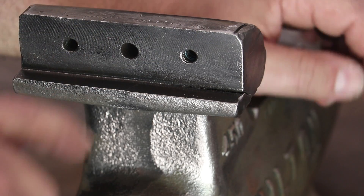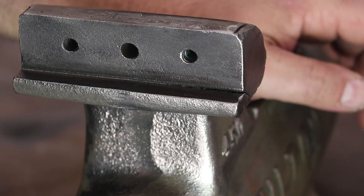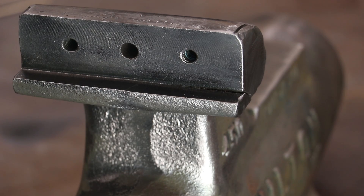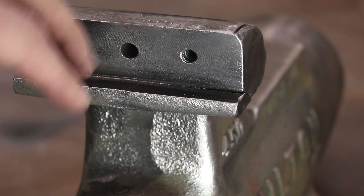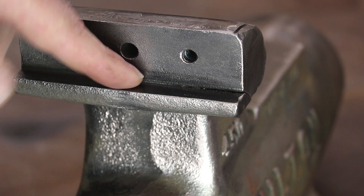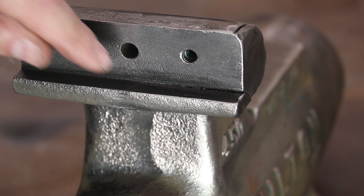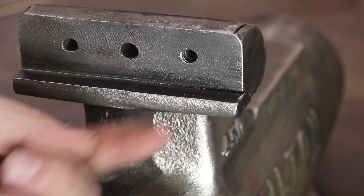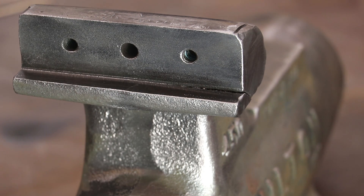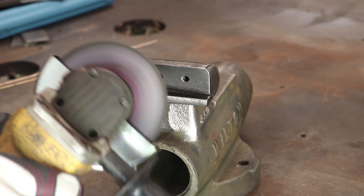Next thing we want to do is open up that little crack down in the bottom and actually get it where I can get some braze to flow down in there to fill that in really well. To do that I'm going to use a little cutoff wheel to go in there and just make a slot. We're going to be doing this all the way around - right here on this face and also across the bottom, just to open all those gaps up. I'm just trying to give a place for my braze to go. I've got a thin cutoff disc here.